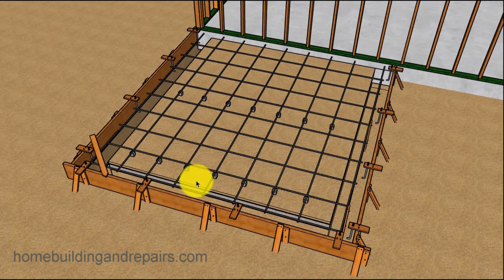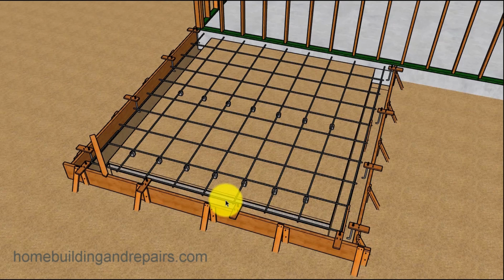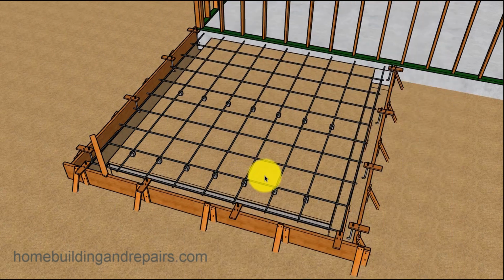All these videos are based off of my experience or things that I have seen built and approved by engineers and city building officials. But again, I live in Southern California. So there aren't any snow loads I have to deal with. I don't have to deal with any frost lines. If you're going to build something like this in an area where the ground freezes, you might have to have 5-foot deep footings. You're going to have to go below the frost line.